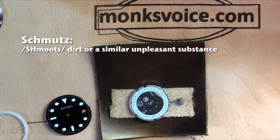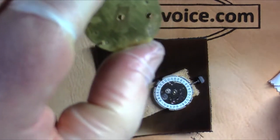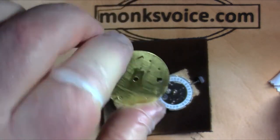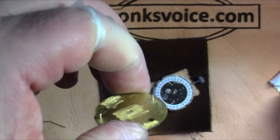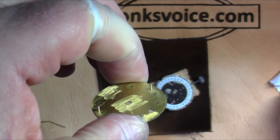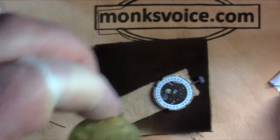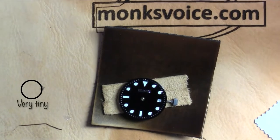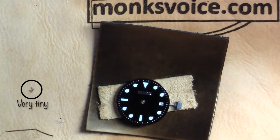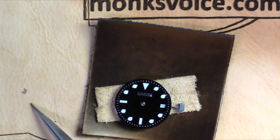I don't know exactly what's inside, but I'm going to use a lint-free cloth and kind of clean all the schmutz off the dial — not a lot, just from transportation. Now on the back of the dial there are these little feet and they were slightly bent from transportation, so I kind of straightened them up really carefully. I didn't want to break them off because it's these little feet that fit onto the movement. The movement secures these dial feet with two tiny, tiny, tiny little screws. I had to use my smallest screwdriver and had to even sharpen up the screwdriver just a little bit in order to fit in the screw head.